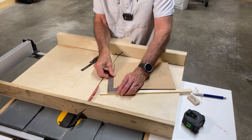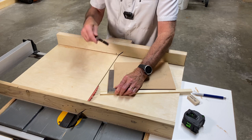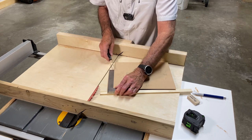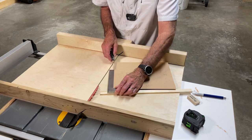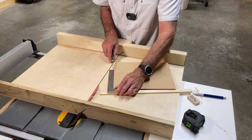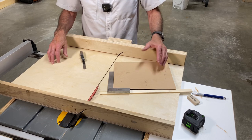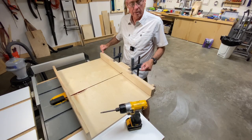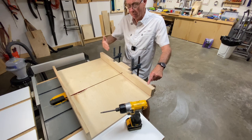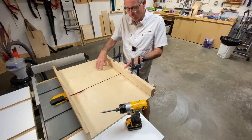After making our adjustment and putting the square back on, I've dropped down to the lowest feeler gauge I have — 0.010 — and I can barely get it under there, actually I can't really even get it in. So it's less than 0.010 out across 20-something inches. That's certainly more accuracy than I'll need, since I won't make any boxes using this jig over 20 inches long. Now we have a screw in the pivot end and a screw on the left-hand side of the fence, and we know it's very accurate. So we can go ahead and screw down the rest of the fence to the base of the sled.